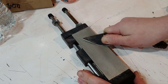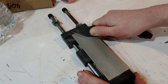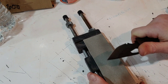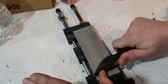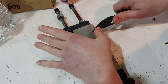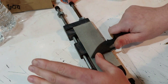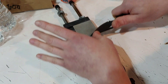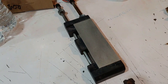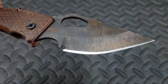This is how I sharpened it: two diamond plates, starting with 300 grit. Mostly one-handed, but I did use my other hand at times — especially pushing the tip down toward the stone when going back the other direction. You can see me rolling the tip toward the stone when I get past that belly, because it does have a significant swoop up the blade. It's a unique blade shape, but you get used to it. This is a 600-grit edge all sharpened up. Not my best edge, but very sharp.